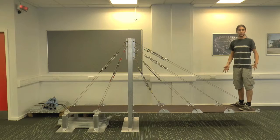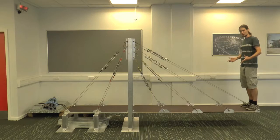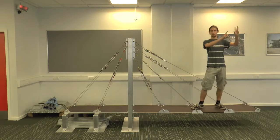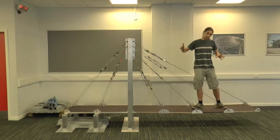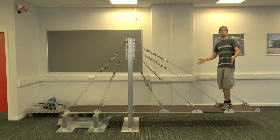This phenomenon is called resonance. It's when the movement of the dynamic loading — maybe people walking on a bridge — is at the same frequency as how the bridge deflects while being loaded. If these two work together at the same frequency, like someone swinging on a swing — kicking their legs up at the top and leaning forward on the other side — they'll reinforce each other, making the swing larger and larger. The same is true with the resonant frequency: if that's hit, the deflections reinforce each other, the deflection will get bigger, and you will eventually see really catastrophic behaviour.